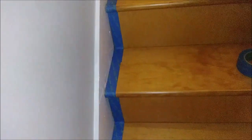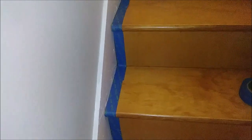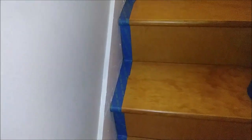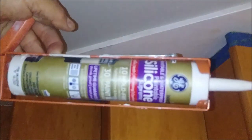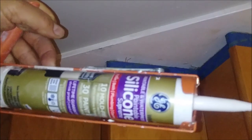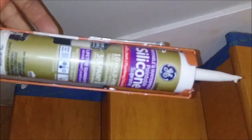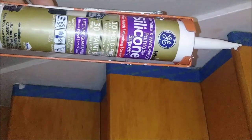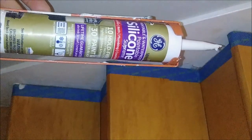Here is another place. What I'm going to do now is put silicone, using a special tool called ProCaulk to push the silicone inside the gap. This is the GE silicone I'm using — it's paintable and waterproof, 10-year mold-free. That's very important because mold can develop on the side of the wood on stairs.